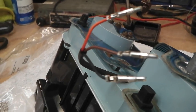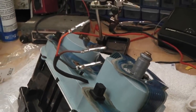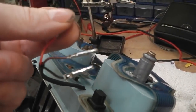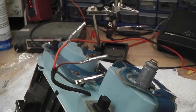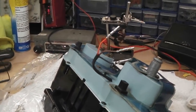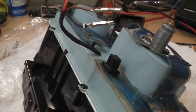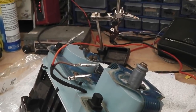With the dash lights nicely sorted, now I'm going to fit a Molex plug to this extra plug that we have to have on the back of the dash to pick up the fan indicating solenoid and the cruise control indicator and a ground for those two. So just a simple, I'm using a 4-way Molex that gives me a spare if I ever needed it. I haven't got any 3-ways in stock, so we just crimp and then we'll crimp and solder these Molexes, then the female version on the other side, and then we'll make a piece of loom long enough to trim down to what we need. Then it's just ready to go.